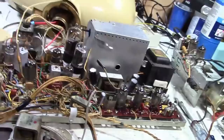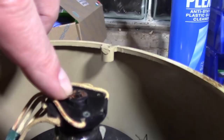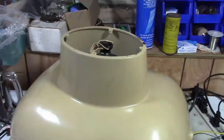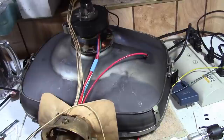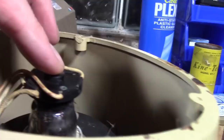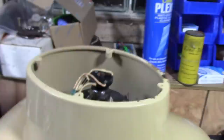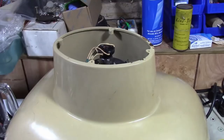I will use the original backplate that has the note about it being rewired. Something I noticed when putting the socket back on — there's this little glass nipple where they would have sealed off the vacuum. The original CRTs for the predicta have a really short neck — less than 11 inches front to rear, which was an innovation at the time. There are over a dozen 17-inch 110-degree deflection CRTs available, but most have longer necks including this replacement one. It just barely fits, and I wonder if somebody snapped that nipple off to make it fit — though that would take some nerve with the risk of the CRT imploding.